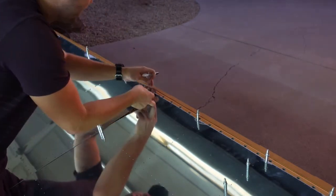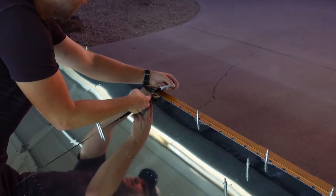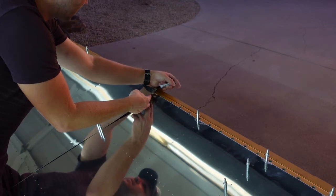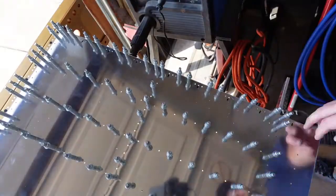So that's gonna go there, and then this one here, eyeballing from here, I'll make a nicer triangle after the fact, but just kind of putting a marker where the material is supposed to be sanded. The idea with the scarf joint is you get these two layers to sit just a little bit lower. My understanding from other people out there is you never really get it perfect, but you just get it acceptable by just having a little bit lower of an interference up top there. So anyways, I'll be doing it.